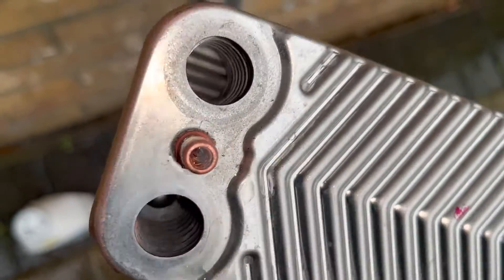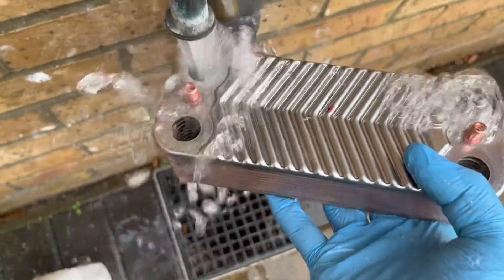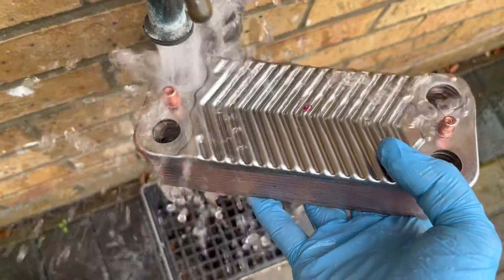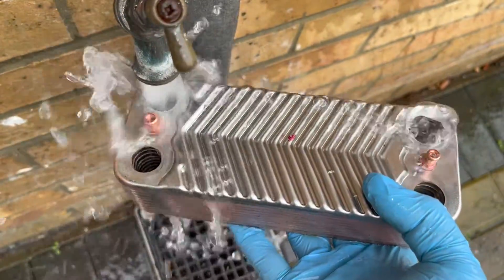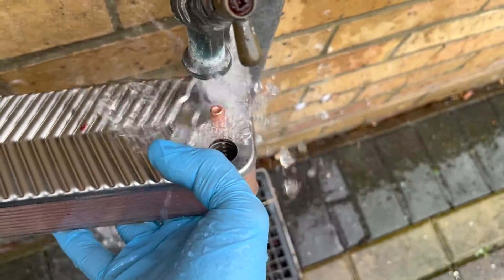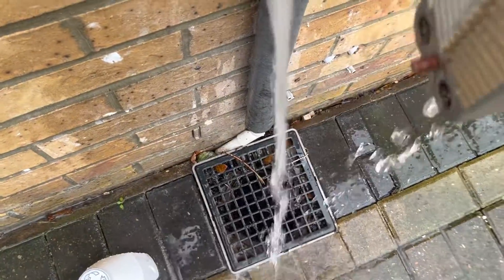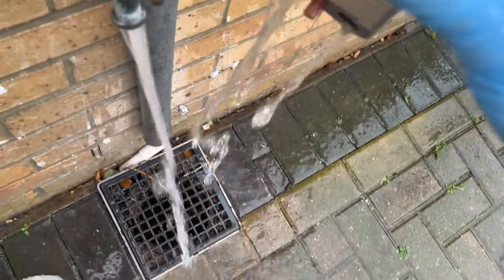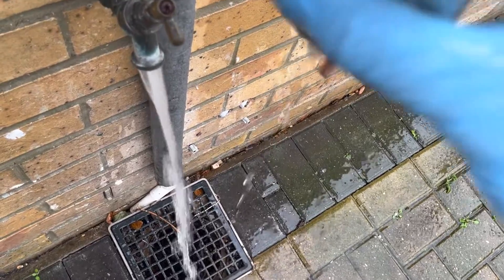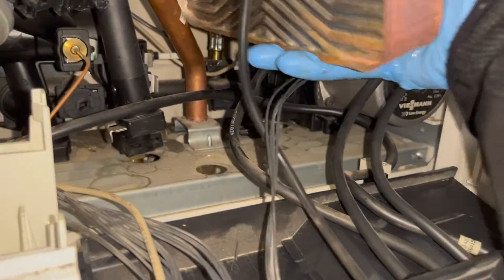Basically like new — you don't even need to buy a new plate. But just a quick reason why you might need to change the plate: sometimes if it's completely blocked you can buy a new one, but the main reason you'd need to replace it is if it pinholes. If these plates pinhole, the central heating and the cold water will be mixing, and you'll know this because the pressure will always be going up in the boiler even though the filling loop is shut. If you talk to technical support they'll always recommend changing the plate, but you don't always need to — spirit of salts can do a good job.